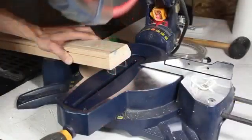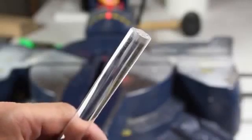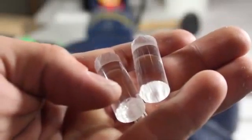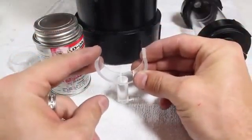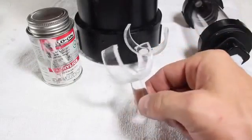The other circle is cut, and a belt sander is used to match the pieces as closely as possible. I've got some leftover acrylic rod from my fire piston project, and I'll cut off two pieces about 1.5 inches long. I'll use some acrylic glue to secure the clips to the connector rods, and after 2 minutes they're firm, but will still take over 2 days to fully cure.